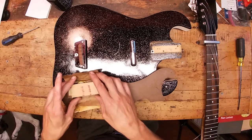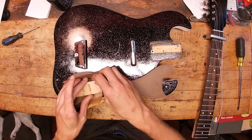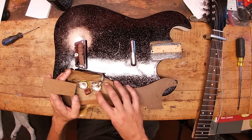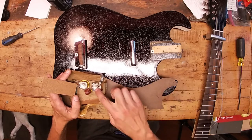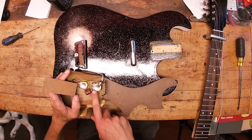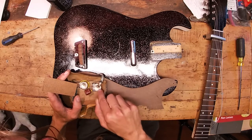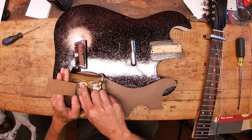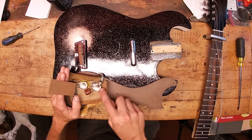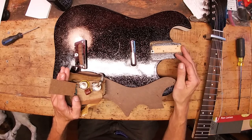There's another little piece of masonite in here with the number 2044 on it — same as the neck date. I'm not really sure if that's a production number or a year. In here the pot codes are 137 — that's CTS — though they do look a little different than other ones — and 64, so that's going to be 1964, 13th week of production. The part numbers are 2749, and this pot — the volume control — is 100k.